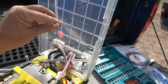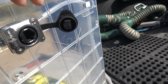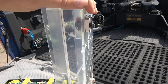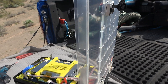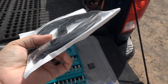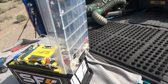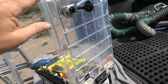On the top I had to disconnect this to get the lid up. Up here we have an RS-485 connector port, which connects to inverters and systems like the Victron system and laptops to use different software. They do give you a cable — on one end is the connector, on the other end is a USB connector. There are a few videos on their channel about it; it's something we can maybe explore in the future.